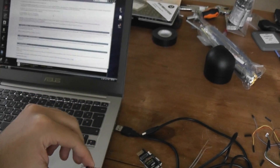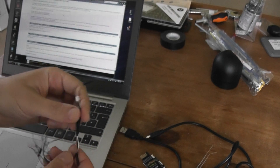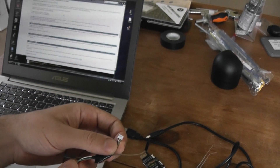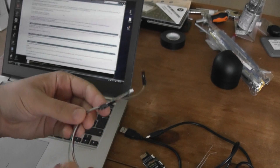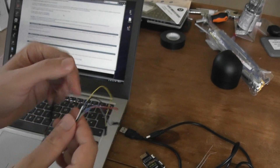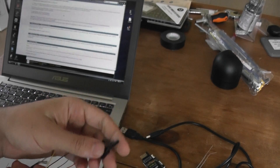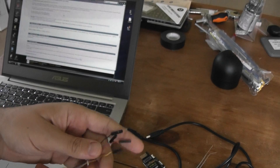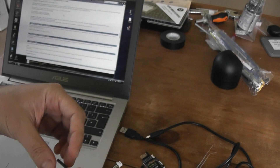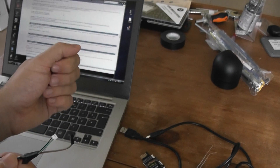My video will show how to update without using any external board. I will just use some basic wiring. From my FrSky receiver, I received a cable with four pins and a JST connector, and I soldered four extensions ending with male connectors in Arduino Dupont format. I also cut some Dupont wire and did some soldering. I will use an external small female-to-female Dupont wire in order to provide VCC for the FrSky receiver.